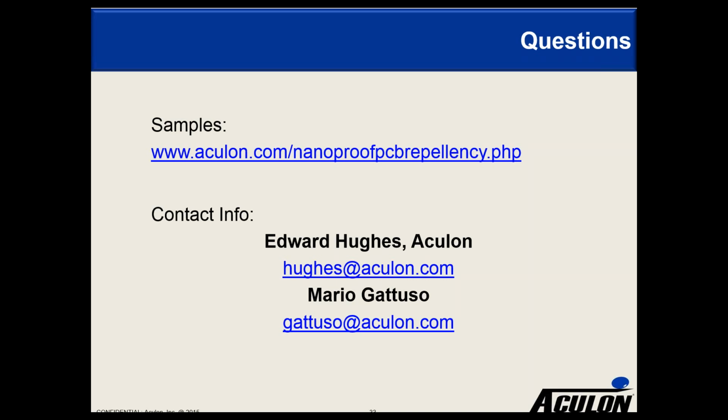What intensity of UV light is advised for the UV tracer is another question that's come in. Let me see if I can find that out. It's fairly weak UV illumination. These are basically handheld spot check units, the kind of thing you might use in an airplane factory, ones they use to inspect turbines, or the ones that are used in laboratories. It's a 4-watt UV lamp at 365 nanometers that I'm using to see in the lab, and I get great visualization from that.